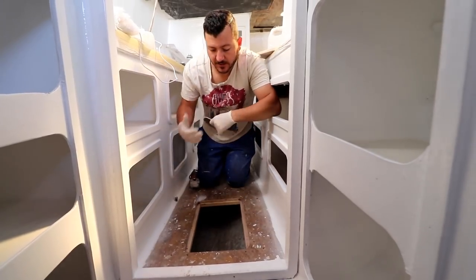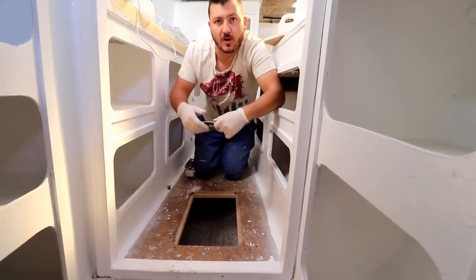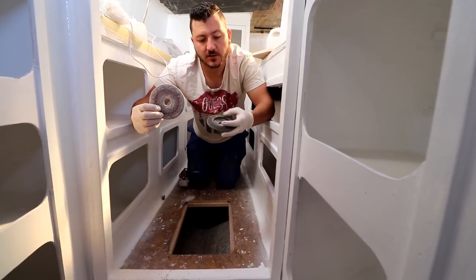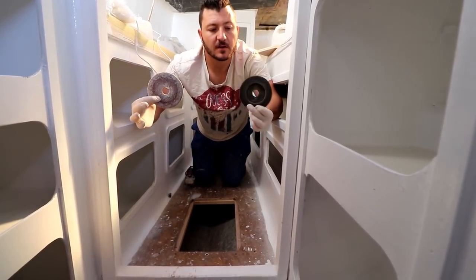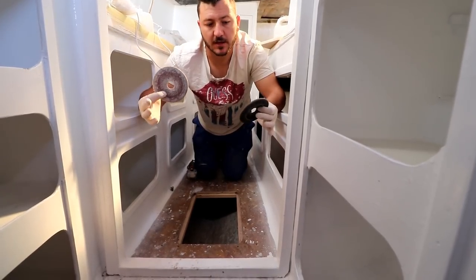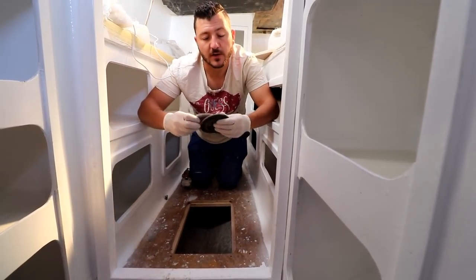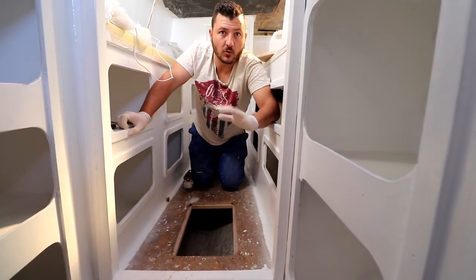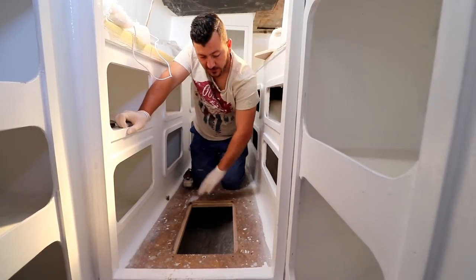As you can see, here's one of our bilge areas. What we've done is grind it down using a sanding disc that goes on a grinder, or alternatively one of these flapper discs — this is more cost-effective. Both processes make a lot of dust; you can get a guard on your grinder that connects to a vacuum. Alternatively, you can use an orbital sander with a nice coarse grit — the coarsest grit we could find was 40.